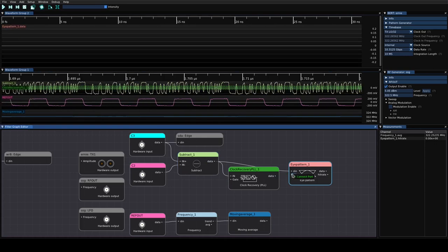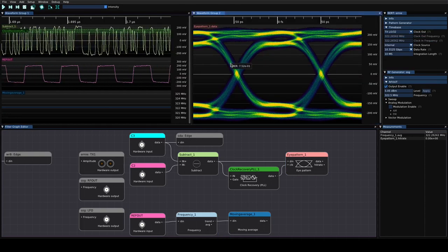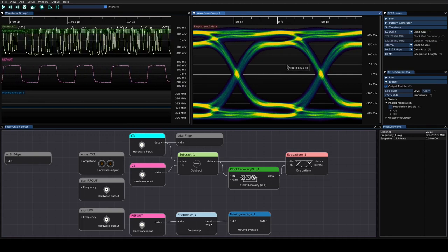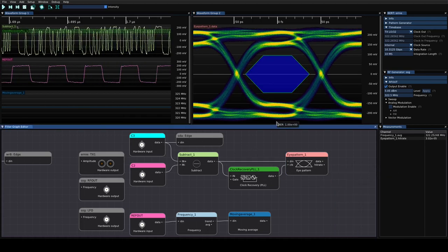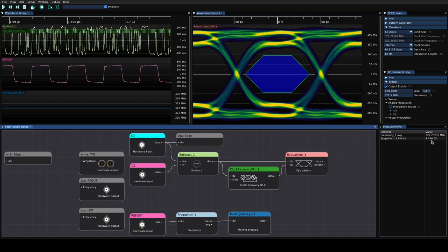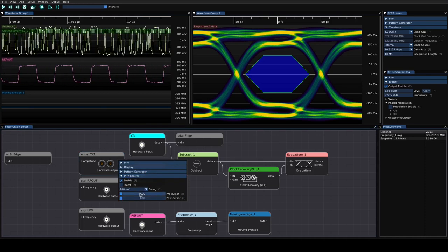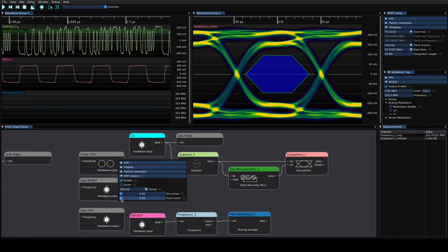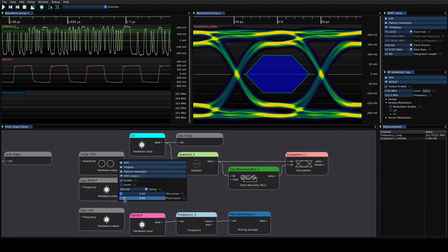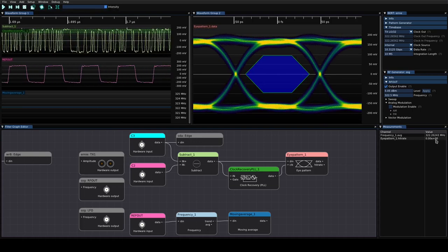Pulling up an eye pattern on the differential signal, we dock it to the right so it's not blocking the waveform view. We're running at 10 Gbps simulating a 10GbE link, so we can pull up the eye mask for XFI. We're passing that with a 10^-5 hit rate — so kind of marginal. There's a little bit of eye closure, but we can improve that easily by going to the equalizer settings on the transmit port. The swing is currently at 200 mV and the FFE for both precursor and postcursor are at 0. From our previous testing, turning the postcursor tap up to about 12 gives a much prettier eye that no longer hits the mask at all.